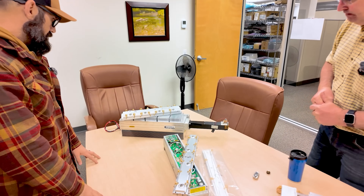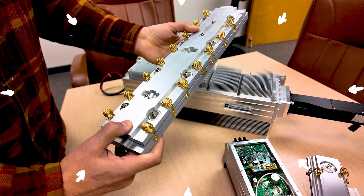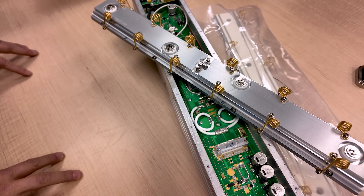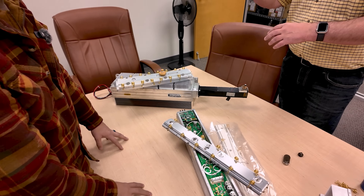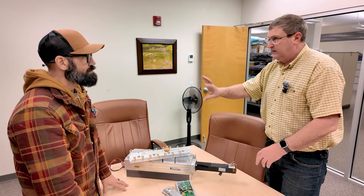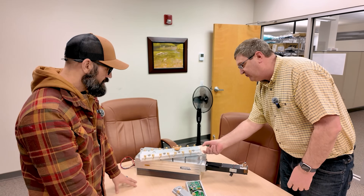RF power is delivered through the tube wall — another aluminum housing — through this feed-through which connects to the electrodes here. We put the RF energy in at 100 MHz, which is an AC frequency. The field goes back and forth at 100 million times a second, and that creates what they call a discharge.